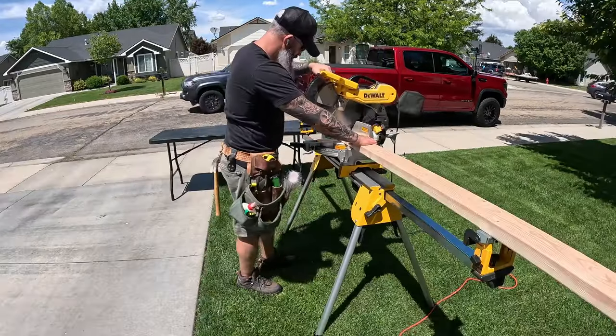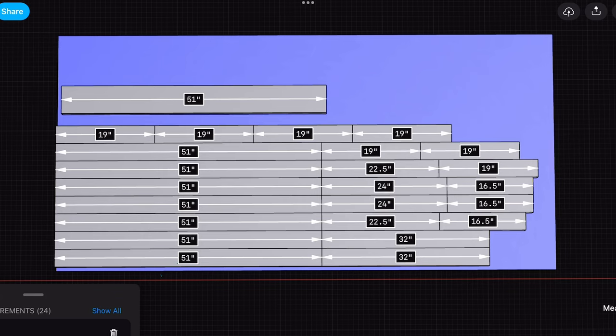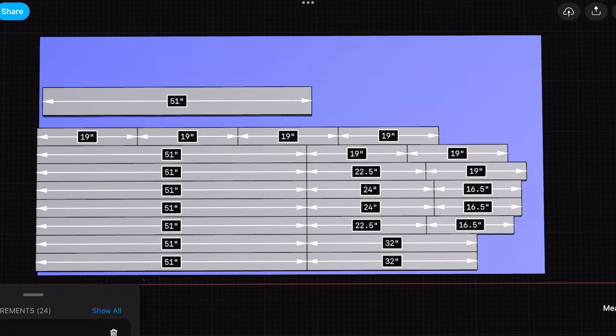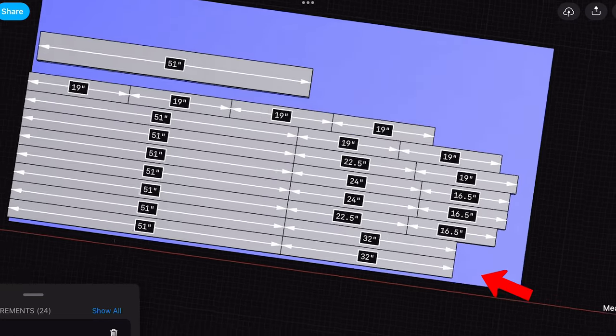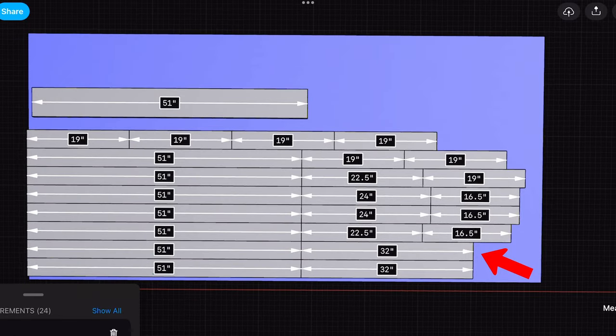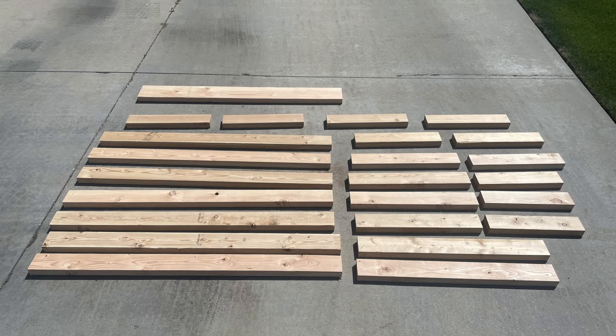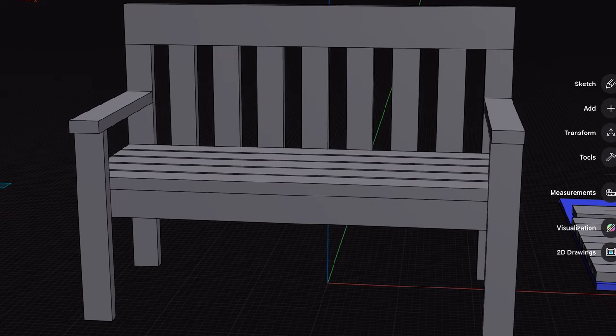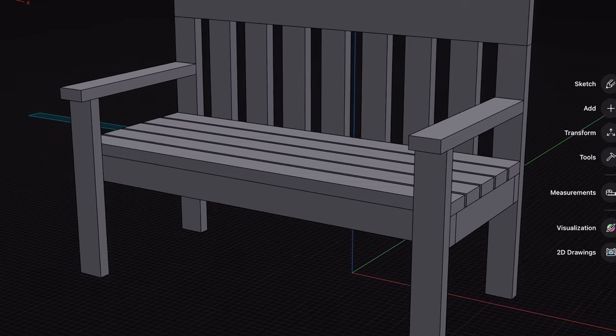To start out we're going to pre-cut all of our boards. This picture shows you the cut list, so you can pause the video here and take notes if you wish. Each row is one 2x — so this row came from one 2x4, this row came from the next 2x4, and so on until you get to the very top. This top board came from a 2x6. I planned this out ahead of time to minimize waste using an app on my iPad called Shaper 3D. I'm not sponsored by them, but it's a great app for your design process if you like to design things ahead of time.